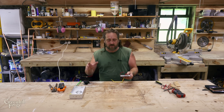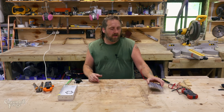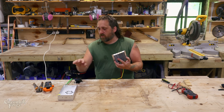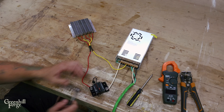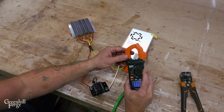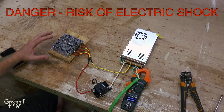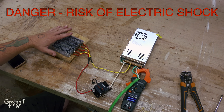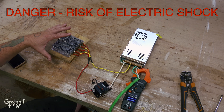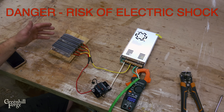So I don't need any other parts — I just need two solar panels, a fuse or breaker, and this. To hook this up, I'm going to connect it to a 12-volt power supply just to make sure everything's running fine. I'm going to throw an amp meter on here so I can see how much power it's drawing. Just a word of warning: when these things are powered, they're live. They're hot and they are not insulated, so they cannot be touched and they cannot be touching anything conductive, because they could either give a shock or cause a short. You've got to be really careful around these things.